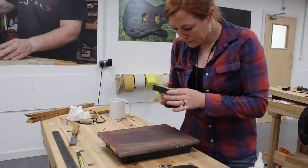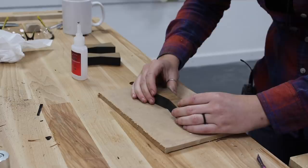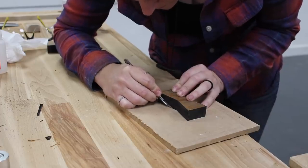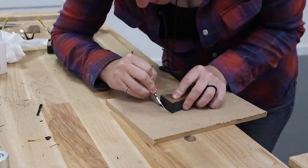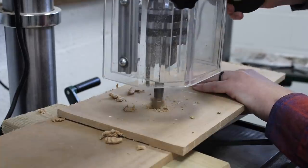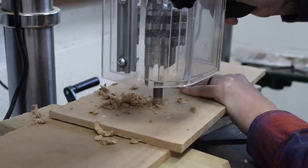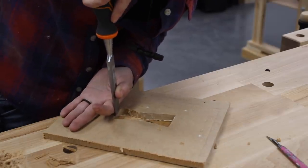I used some snips to cut down the bulk of overhanging holly, then a machinist block — which is perfectly flat — to sand flush. Now to cut the recesses into the body for the bow ties to be inserted into. Chris suggested spending the time making one template from MDF that would allow me to use a router to cut all three recesses pretty quickly. I stuck one bow tie on a scrap piece, scribed around it with a scalpel, used a Forstner bit and drill press to remove the bulk of material from the center, then cleaned up the perimeter with a chisel.